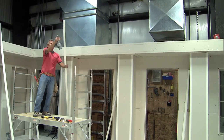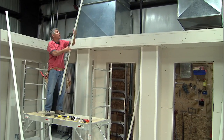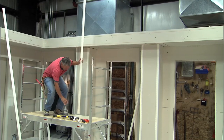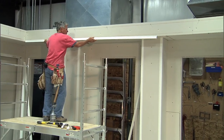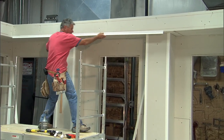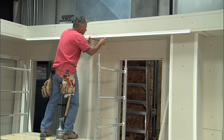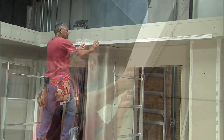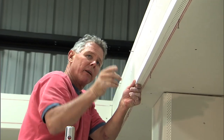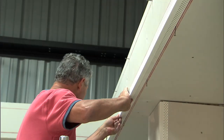I've got my corner, my 10-footer. I'm going to concentrate on getting this thing right in line. I'm not having to look at the nail or look at the bottom line because the nails are holding it right in place. As I'm coming down this way, you'll see this kicking out. I'm going to have to put more mud here because of the high point in the center — I'm actually bringing the corner out this way to make this soffit straight.